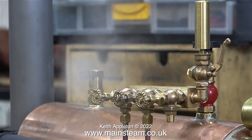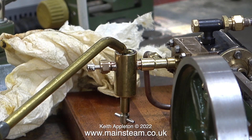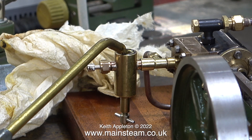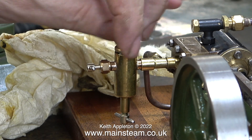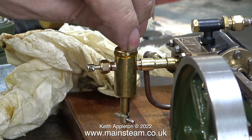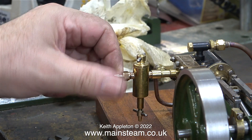Suddenly, the safety valve blew off at 60 pounds per square inch. I'm finishing the filling of the lubricator on the S50. You can now see the importance of closing the master steam valve — if the steam valve was open, this part of the job would not be fun.